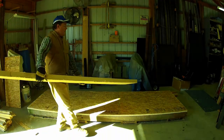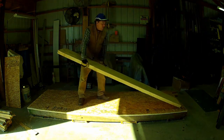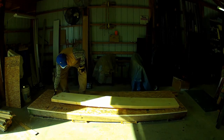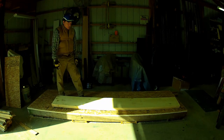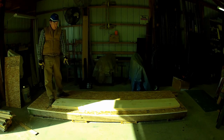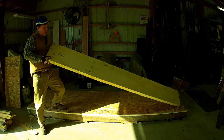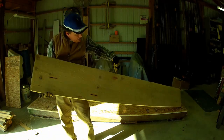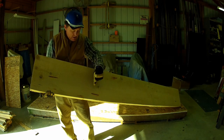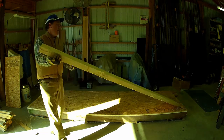Now that we've got some wood, let's see how this lays out. I dug down a little farther in the stack to get some of these big thick ones, because they are the reason for this firing of the kiln. Right there you can see — bring this up to the camera — what we're trying to set. These are the pitch pockets that we need to get the pitch to solidify in. The ones on the outside aren't the ones I'm worried about; it's the ones you can't see that are going to weep.